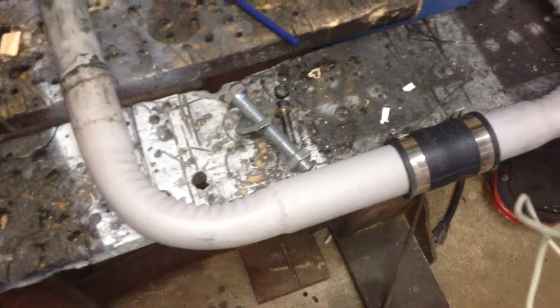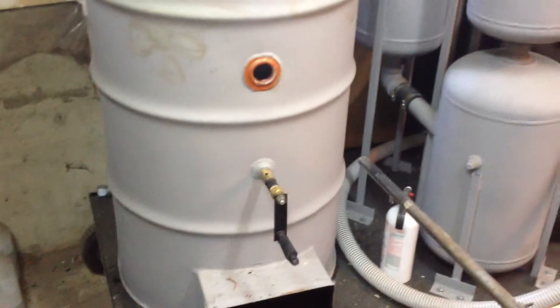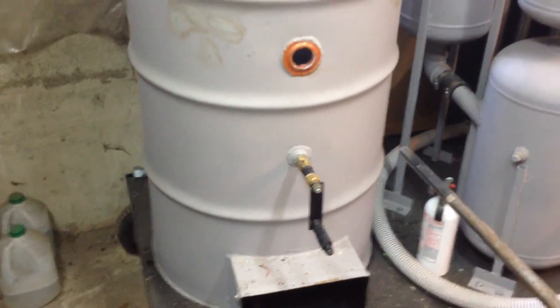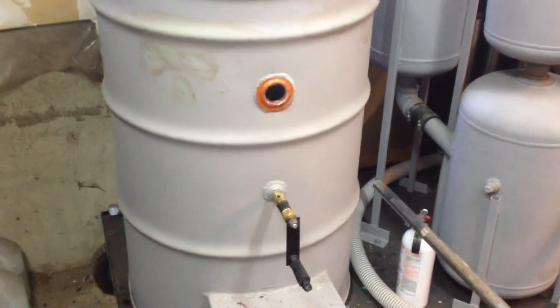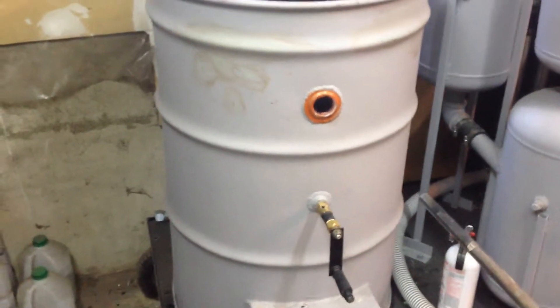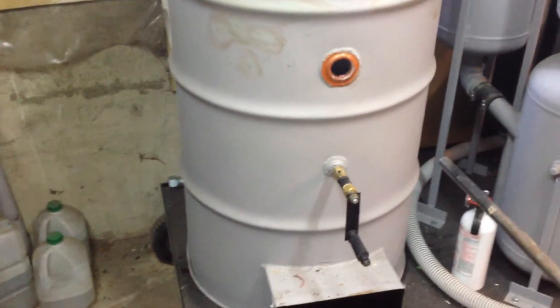I've been having some issues with my wood gasifier. The beginning was great, and then I ran it for a little bit and she's really getting dirty. I noticed it was clogged, full of soot, and I had some tarring issues in the beginning too. That's probably because of the use of wood pellets being moist — it's kind of like the domino effect, where everything starts to go haywire one after the next.